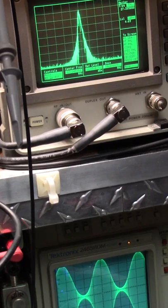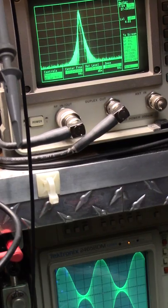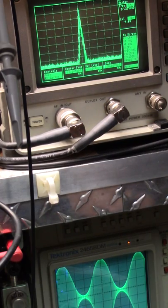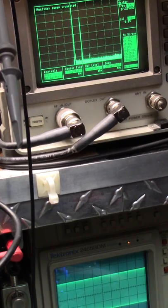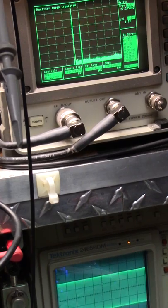Crystal clear. I have it cut off at 4,500 at 50% modulation, good frequency response. Use the SRA-198. It's going to be a core radio. That was 1 kilohertz. Let's go to 30 kilohertz. Let's just go to 1 megahertz. We see it there, 1 megahertz span. Go to 30 megahertz, we'll look for any unwanted anything. Let's go to 300, and it's got max mod too. You'll see the first at 54. It's way on down there, way on down, okay?